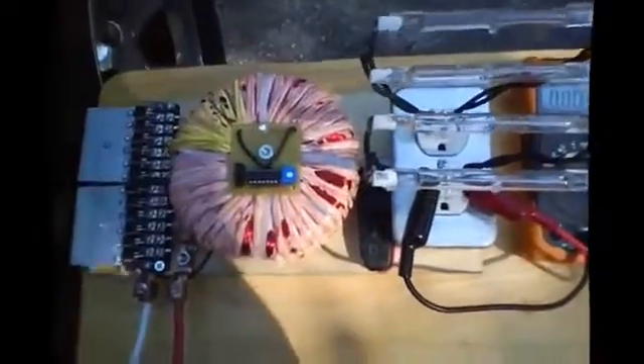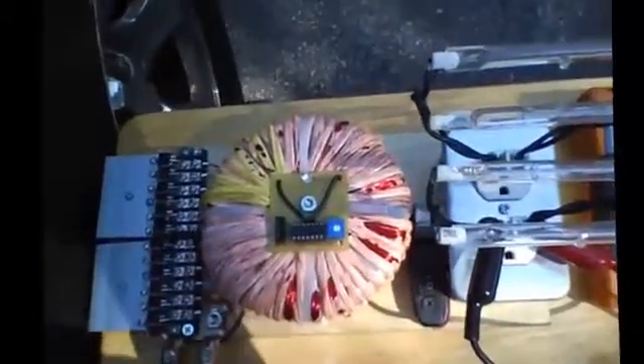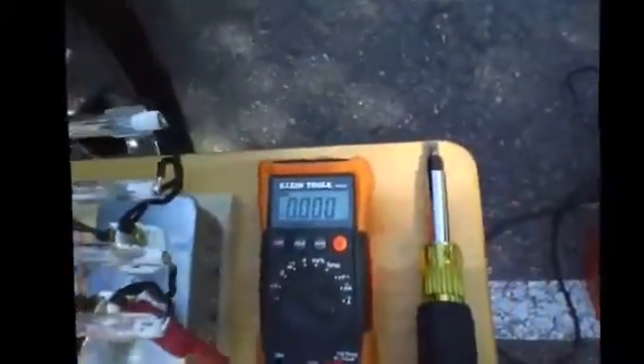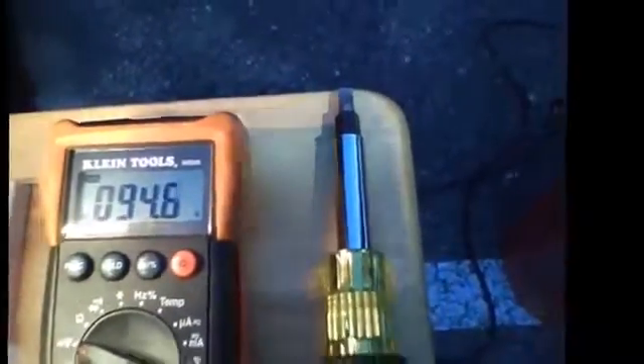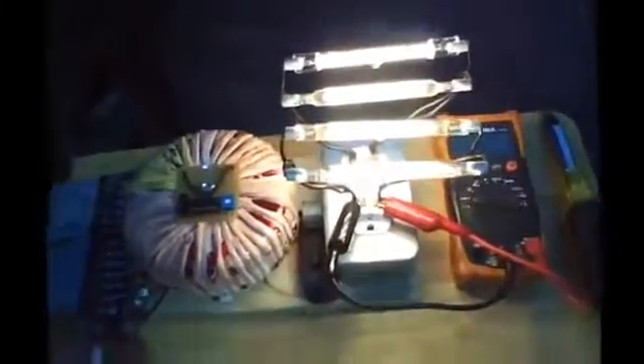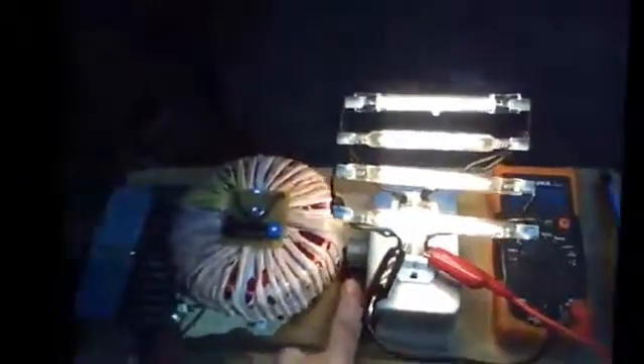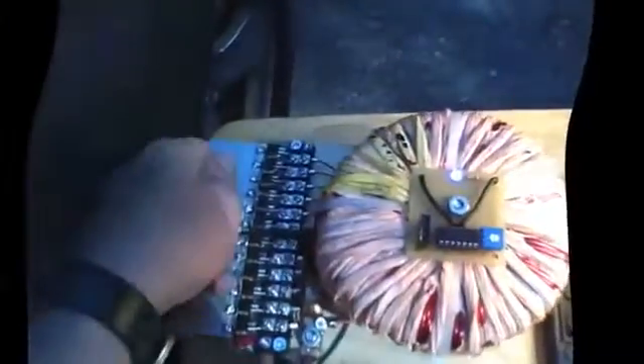Okay, we're back. I have my engine revved up to around 1700 RPMs to help it out. This really draws a lot of current from the battery. I'm only using 6-gauge alternator wire, which I really need more of to get a good amp pull. But this is 2000 watts of power right here. The voltage is a little low — 95, 96 volts at 119 amps. Got them all lit up. The core is now starting to warm up from the intense heat, but it's powering them up. That's the power this thing is pushing — doing an excellent job on this little core. These are still just warm. Pretty amazing.